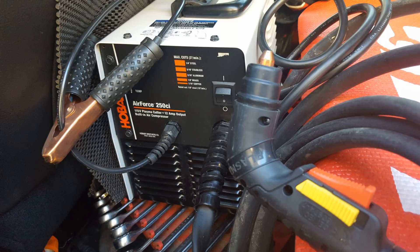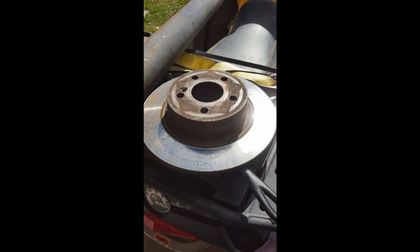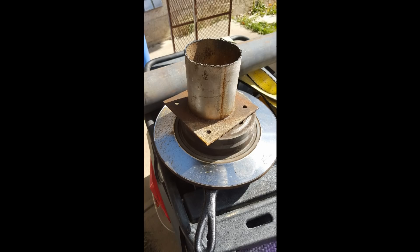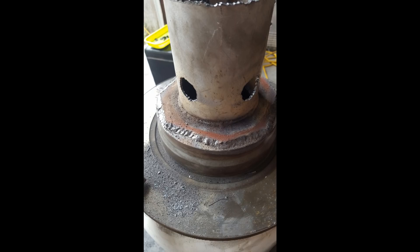For this project I had a plasma cutter which helped me a ton — it's very easy to do. You also need a welder. I found some scrap metal including a propane tank, cut a couple pieces off it, and some of it I could reuse. I found an enclosed brake disc and cast iron pan, which turned out to not work very well as it takes way too long to heat up. I then tried just a steel pan to see how it would burn, and it got to temperature way quicker and burnt way nicer.